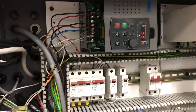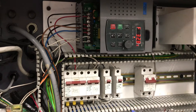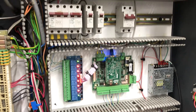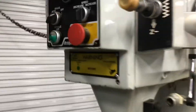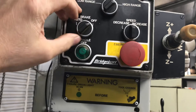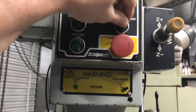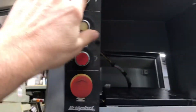I will include the screenshot from Amazon and make notes in case anybody's trying to do this — it was a bit of figuring things out. Here's the inside of the cabinet. All I've got left to do now is hook up the limit switches and the controls on the front of the machine. I was able to repurpose one of those transformers for one of the drives. I'm not going to hook up the brake because I don't have the clevis for it, but I am going to hook up the speed increase/decrease and the emergency stop.